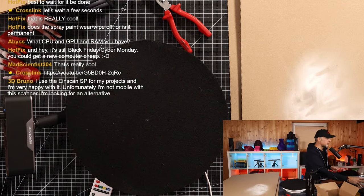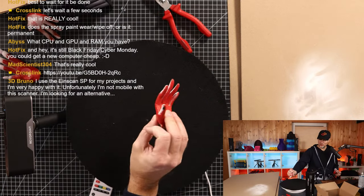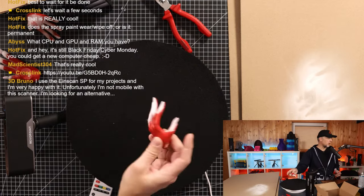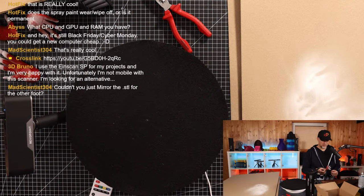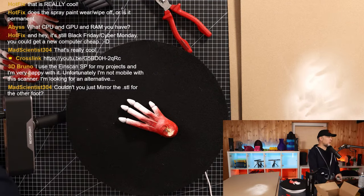Okay. Good. Last scanning spray session for today, hopefully. Needs to dry a little bit. And then it's pretty stable for probably 1 or 1.5 hours. And then it disappears, right? If you look at this hand, which I think we did in the first session, see, it's already disappearing. And after probably another hour, 1.5 hours, you don't see anything anymore. So there's nothing on you anymore. But since it's a chemical, I wouldn't put it on things where it's going to soak up. So it needs to be a hard surface. And I'm using it indoors now. It's not the best. Stinks a little bit. Hopefully it's not going to kill me.